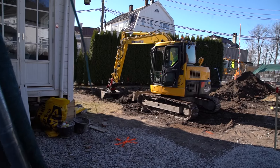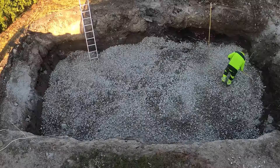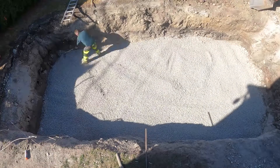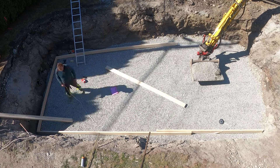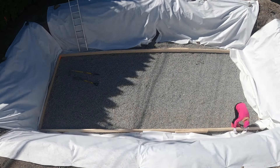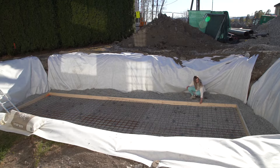Step three: once you have dug the hole, you need to create a foundation. He measured the height to know how much and where to add the rough rubble stones, then compressed it and repeated the process until the ground was level. He then added fine gravel as fill and compressed it again. Then he built the frame where the pool is going to be — measuring in between is key to make it as exact as possible. The white tarp-looking fabric is added to separate the masses, and because we're going to add concrete, reinforcement bars are a necessity.